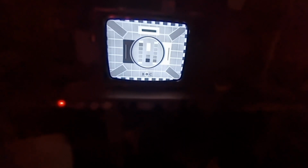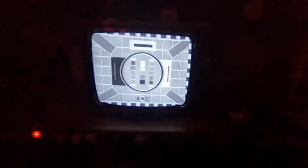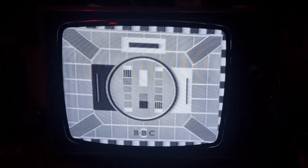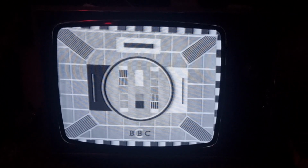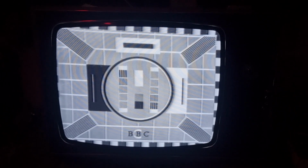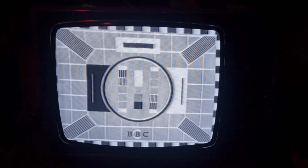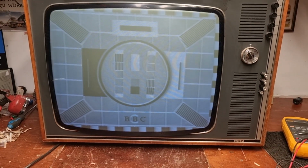Easier said than done. And one thing it's missing is there's usually little bar magnets either side of the scan coils. This one doesn't seem to be fitted with that, so I don't know how close we're going to get it. We should be able to improve on that a little bit. Nice picture, but I don't know, the HF response just isn't there or something. There's something just not quite right about it. I think we might have an issue in the video stage. Any suggestions from GEC experts? We did bang in another PFL 200, but it didn't make any difference.